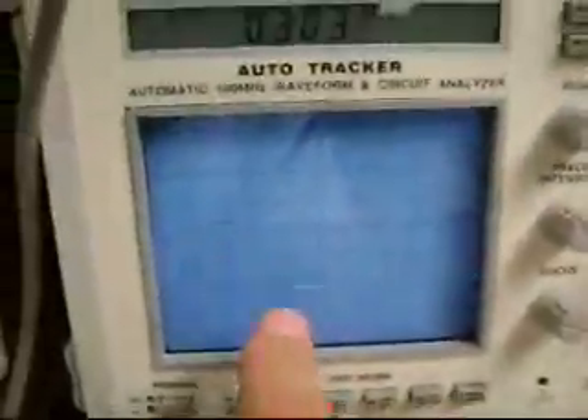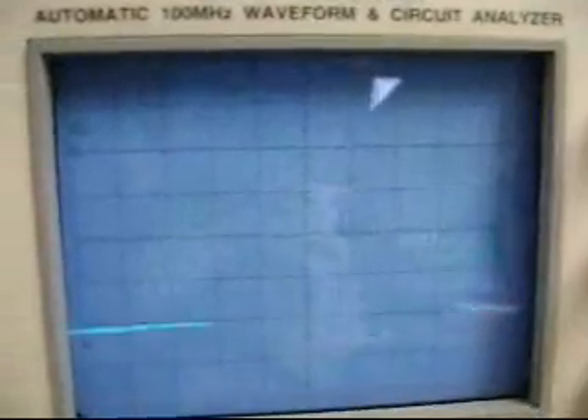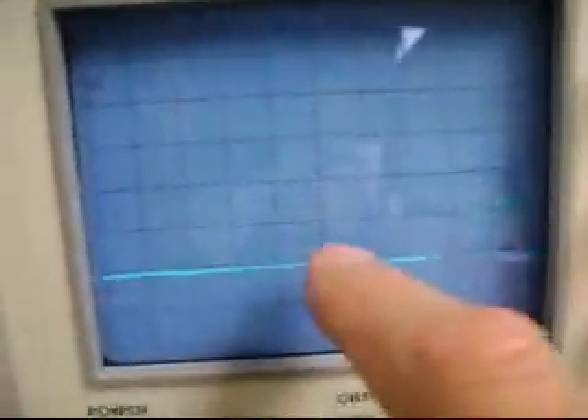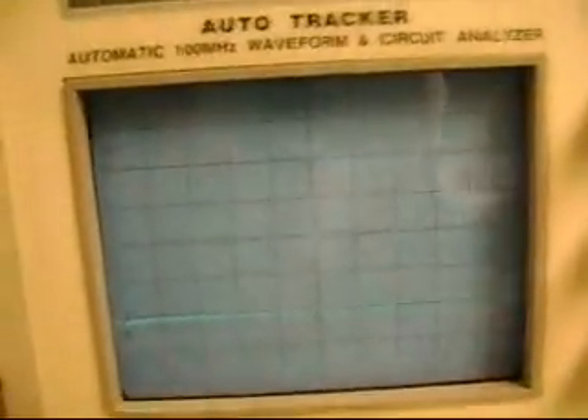What we should be seeing right here is a square wave of about 12 volts, but what we see is pretty much nothing. You might see some sort of small pulses there. Let's turn up the sensitivity and see if we can get the trigger on something. No, there's just nothing there at all. Often you'll see some short pulses — some sort of shark-tooth pulses — but in this case I just don't see anything.